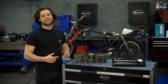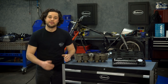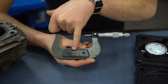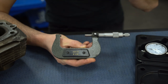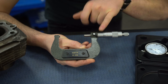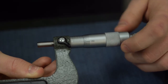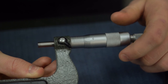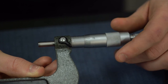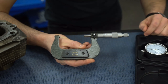We're going to grab our outside micrometer and zero this thing out to 2.44 inches, and then we can get to it. Our outside micrometer here goes from two to three inches and measures down with a thimble. Let's get this bad boy dialed in. There is 2.4 — let's go to 2.450, which is right there, and then we'll just take 10 out. And there you go — there is 2.440.